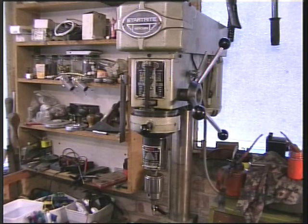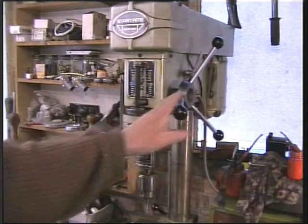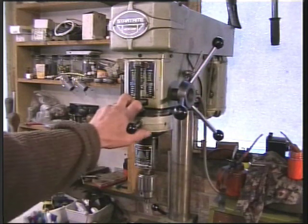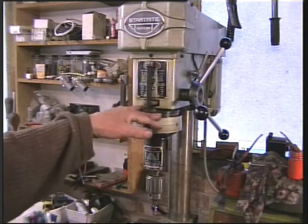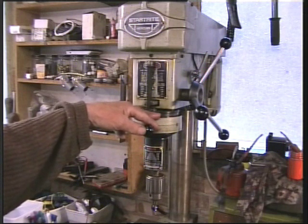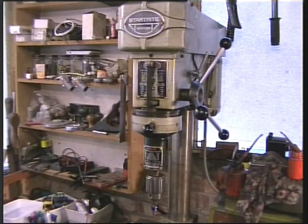Converting 3-phase motors like this means you probably end up with 20-25% less torque than you would have done with a 3-phase. 3-phase motors, after all, are far more powerful size for size than single phase. But they're used in an industrial environment. They're used in hot, continuous conditions, and the average home workshop won't notice any difference. I did exactly the same with the motor in my lathe.